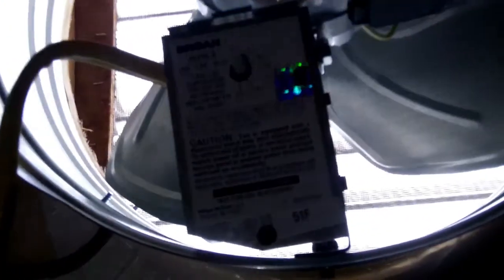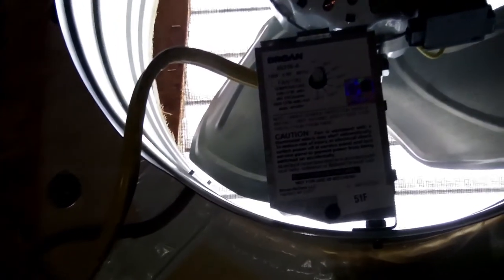I've got the wire snaked up to the fan and I already installed the wiring to the fan motor as per the manufacturer's instructions for using the bypass switch option. It's underneath some of these boards, goes down here, and I drilled a hole down there through one of the base plates, snaking it up here. Drilled another hole through there and wired it up to the motor. The instructions from the manufacturer made it pretty easy to get the bypass switch installed, and the thermostat controls it.